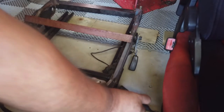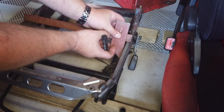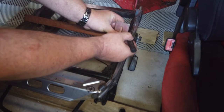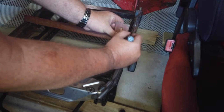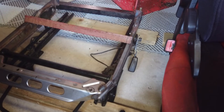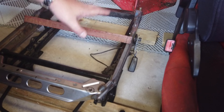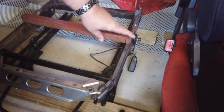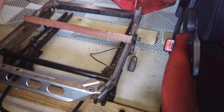So I'll put this down so I don't mumble with my lid in my mouth. So I basically have to notch this bit out. Need a new marker. Right, so if I notch that little bit out, it can go down, and this can be the flat surface on top, and being angle iron, it'll give it a super lot of strength, and I can weld across here, across the side, across the front, and also tack weld it down below. Super strong. I'll do the same on the other side.